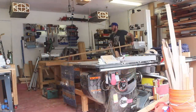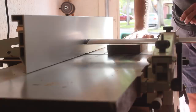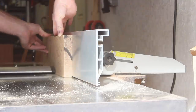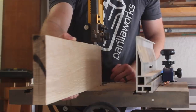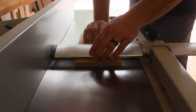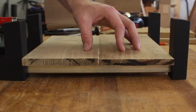So about this little apothecary chest — I've made various sizes of this design in the past and not a ton has changed with the construction. I was able to get every part from a 5-quarter quarter-sawn white oak board. It was oddly warped in multiple directions, which made getting the necessary thicknesses quite challenging. During the production I'll probably use 6-quarter stock just to be safe.